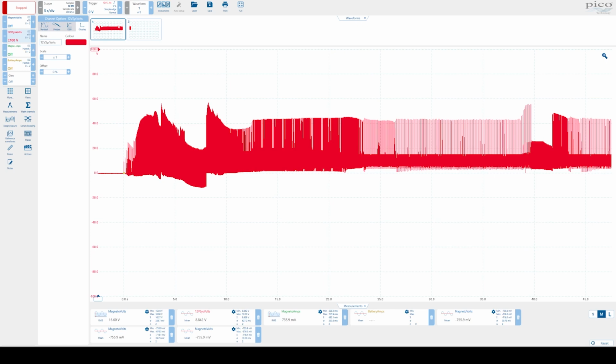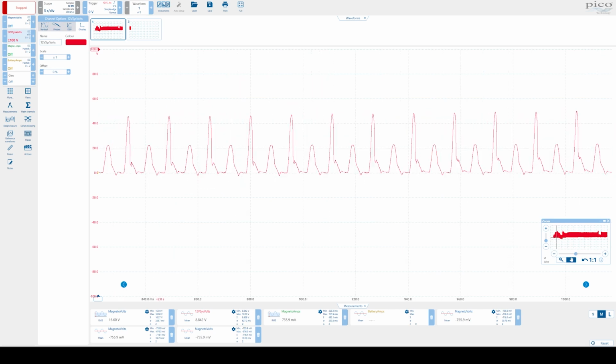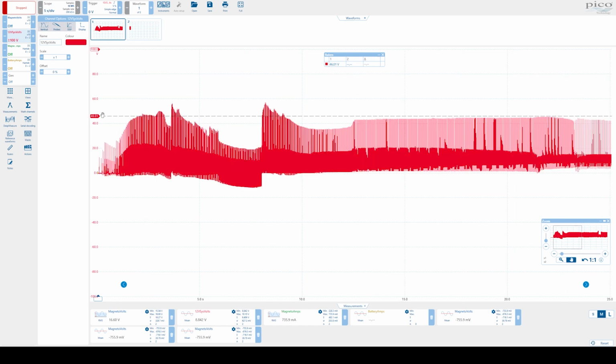All right, so I showed these waveforms last year when I was doing some testing on the snowblower, and in essence we can see here when the LED light died a fiery death, and we're not going to analyze this, but this is what the unprotected waveform looks like. If the battery is not connected or the fuse is pulled or if the battery's dead, like I said. So we've got voltages that peak at about 46 volts, and then later on we actually had the voltages peaking here at 56 volts. The purpose of the overvoltage circuit device is to mitigate this and prevent these voltage spikes from damaging the LED or anything else for that matter. So this is the unprotected version.